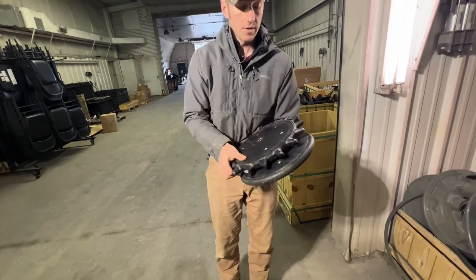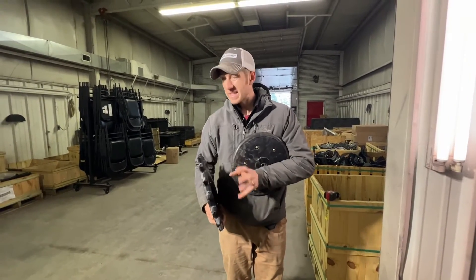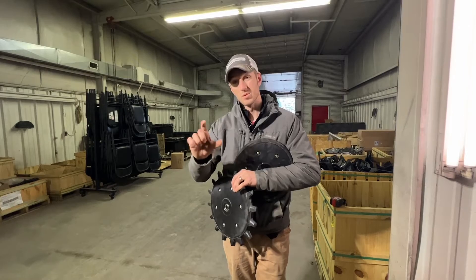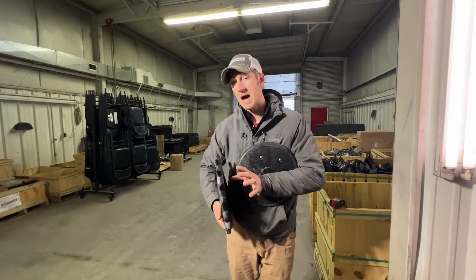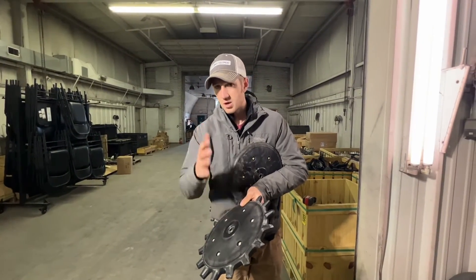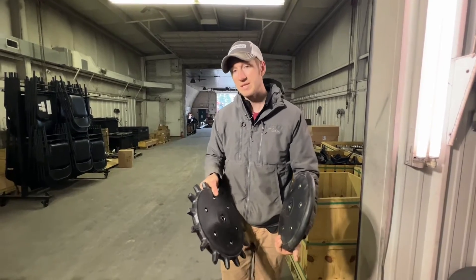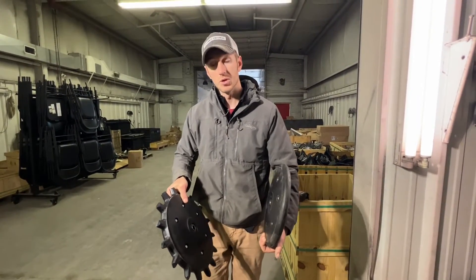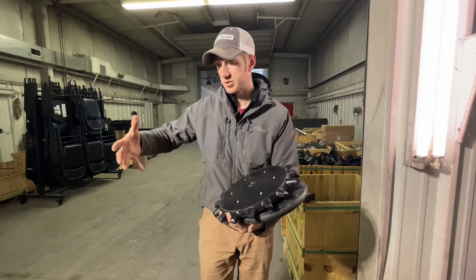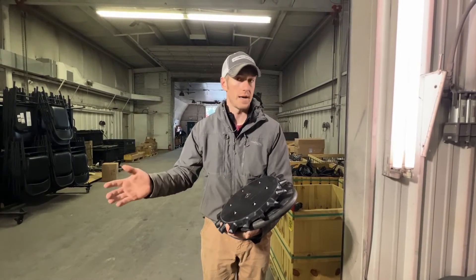The second reason is this spike. Like I said earlier, it's not designed to fully penetrate in the ground — it's not a real aggressive wheel. We're not closing the trench from the outside coming in like we used to with those long spikes. We're closing the trench from the top down. These spikes are running right on the edge of that furrow — you've heard me talk about it — right on the edge of that furrow. We want that inch and a quarter gap. Because they're not a super aggressive wheel, we do need two of them per row to really do a great job of closing that trench.